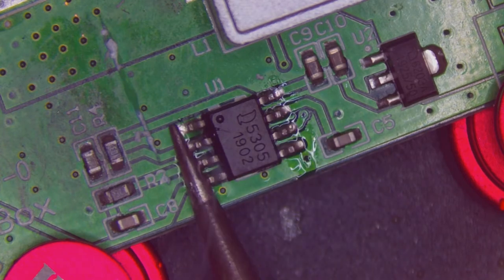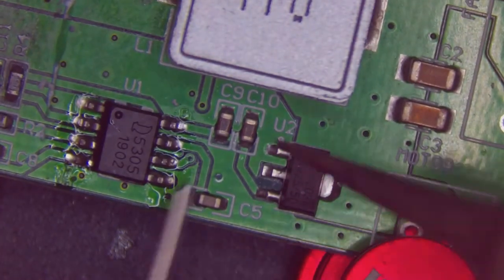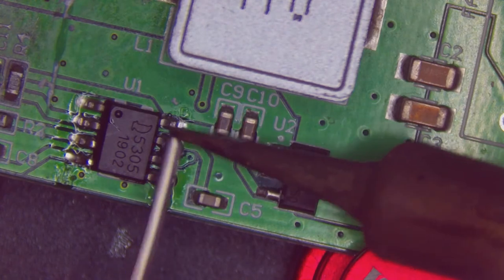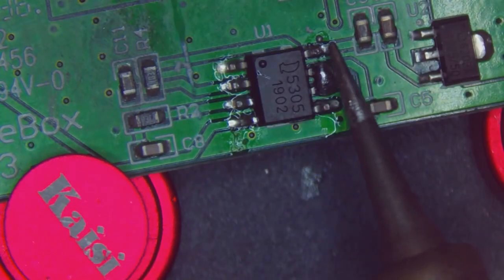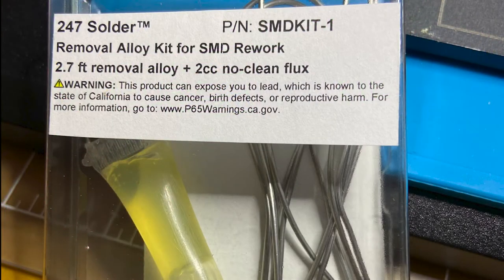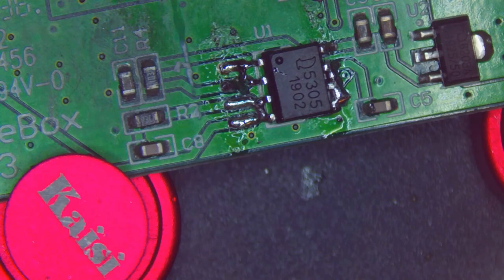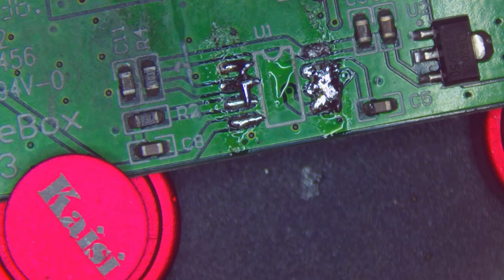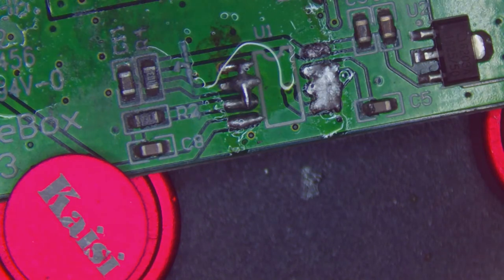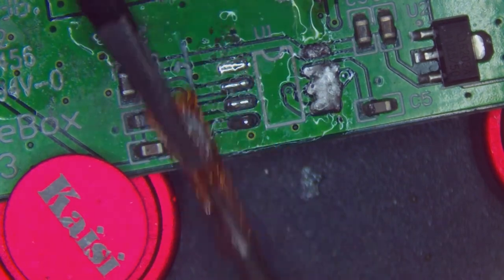So I decided I was going to swap the two ICs to see if I could get the bad board working with the chip from the good board. Here I am removing one of the two ICs with some SMD rework material — this is not really solder. It mixes with the solder on the pads and lowers the melting temperature of the whole mixture and lets you get the chip off, hopefully without burning it. This is the package I picked up off Amazon. It comes with its own flux, and you want to use as little as possible because you're going to have to clean it all off before you can replace the part. But as you can see, it works really well — it came right off with minimal heat applied to the part. To clean the pads off, I flooded the area with flux and then used some solder braid to sop up the excess rework material.